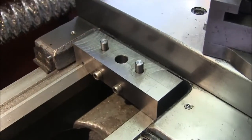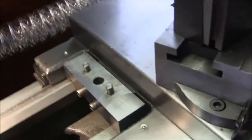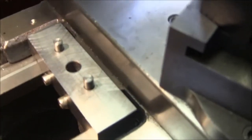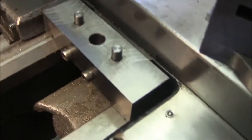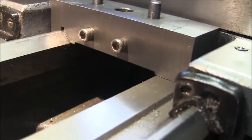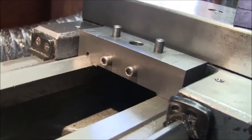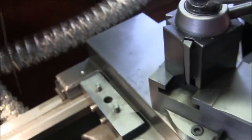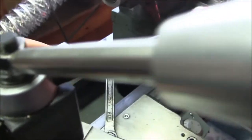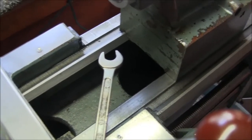Here's one more shot to show you the adapter I've made with the steady off. These two pins locate the steady on center — in this case you'd consider it a follow. You can see it just rides right along on the bed as well. If you want to turn this back into a steady rest, you just unbolt these two, take this off, put it on the other side, and then use the hole down to fix it to the ways.